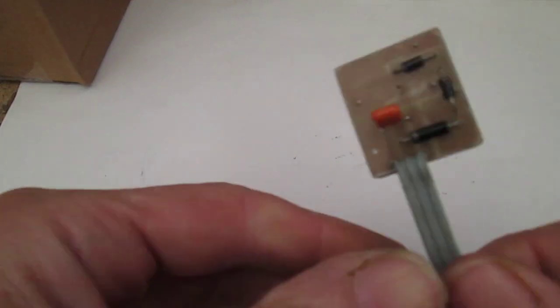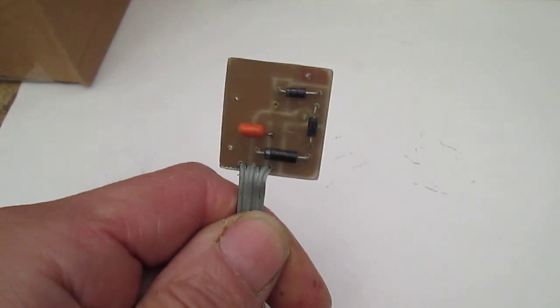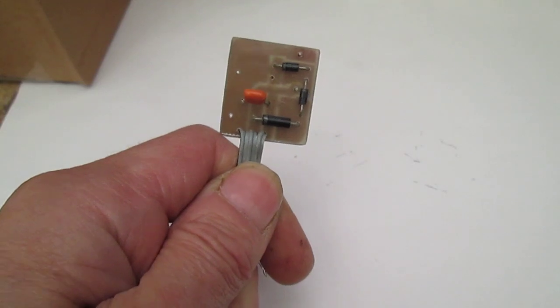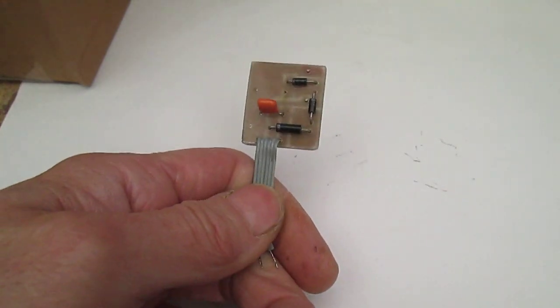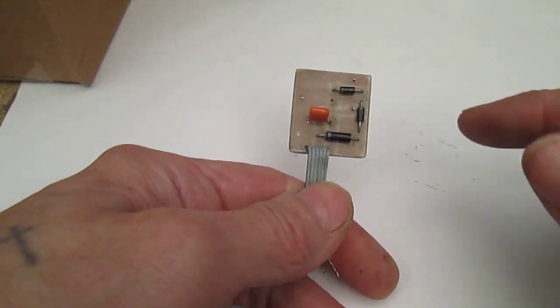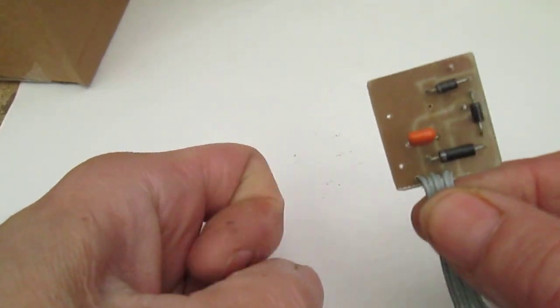Well, one thing I didn't mention about the power supply, the only thing left to fit is a crowbar circuit. Because we're using series pass transistors and an LM317, if anything goes wrong there, then the heaters of the EF86s will see 16 volts DC, which is not a good idea. So it's just a very simple circuit, obviously a bit missing off here, but yeah, I need to fit a crowbar.